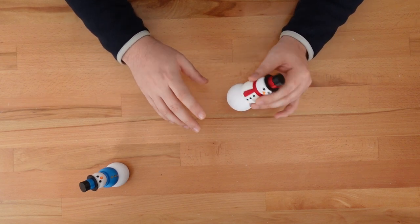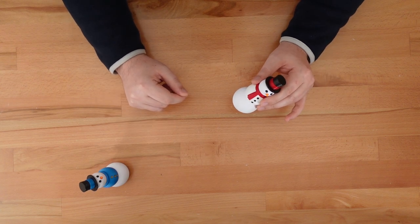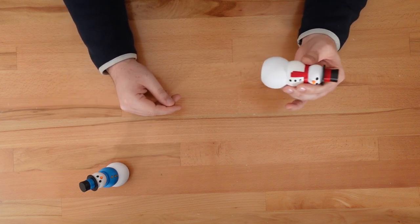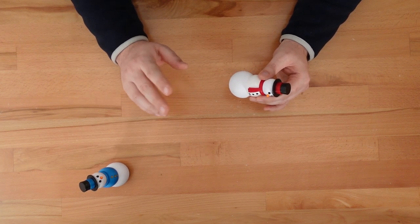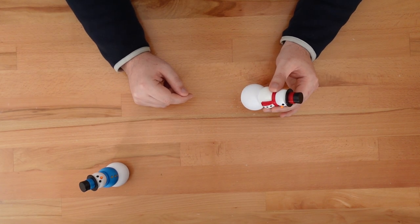Connections between parts start to feel a bit sloppy due to larger than expected clearances. And depending on your infill settings, thicker walls may waste filament or add unnecessary weight. So I've remodeled the design specifically for larger prints.